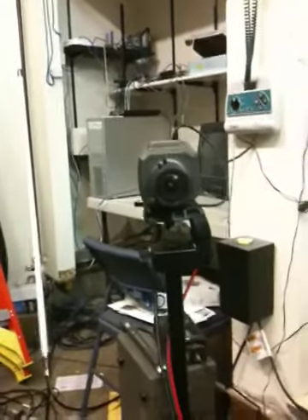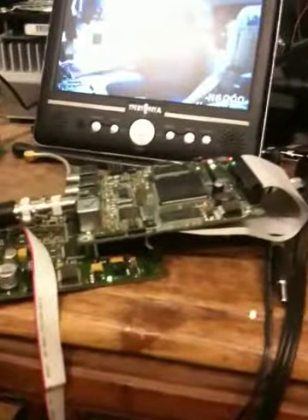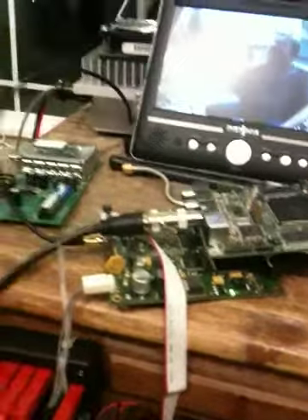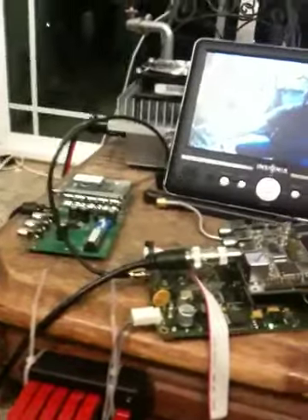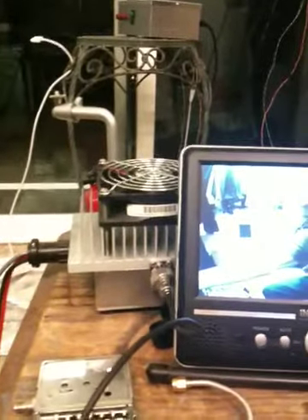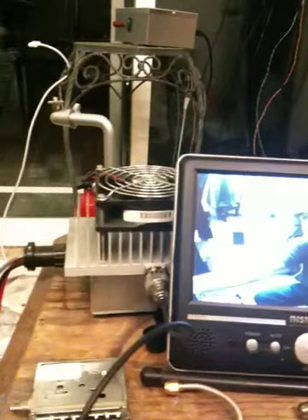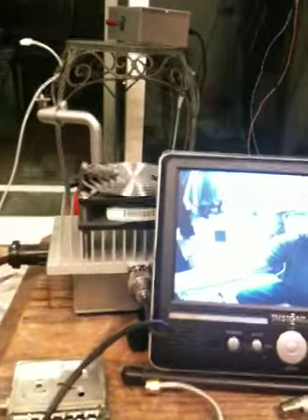There's the camera. I'm filming this on my iPhone, so that's not the same camera, but you get the idea. The camera goes down to the MPEG encoder card right there, hooked up to a second DVB mini-mod — this time it's DVB-S — being output at whatever the drive level is, going back to that 1.2 gigahertz amplifier there. That's the same amplifier I've been using on analog, now amplifying the DVB-S, giving about 4 watts of transmitter power output.